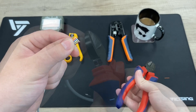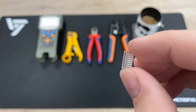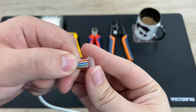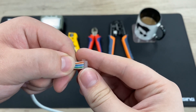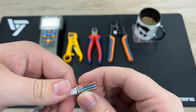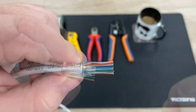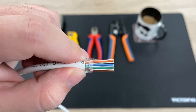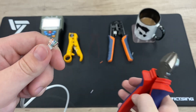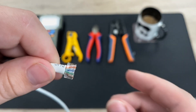Once trimmed, that makes it easier to guide into the two-piece crimp connector. Using the guide, simply slide the cores into it — stripy orange at the top left, with the lip at the top. Slide them down as close to the jacket as possible. Then snip away any excess cores flush to the guide, and give it one final check to make sure all your cores are in the right order and none are crossing over.